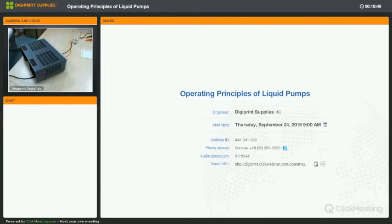Okay, so that's peristaltic pumps and diaphragm pumps and how they operate, how you can test them, how you can maintain them. For peristaltic pumps, use silicone grease both on the rotors inside the pump and on the gears. Peristaltic pumps, you can open them. Just make sure that you don't lose any parts like springs and little protection plates, for instance.